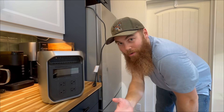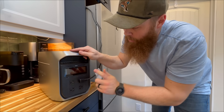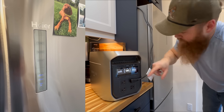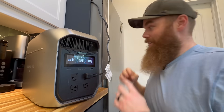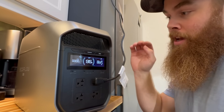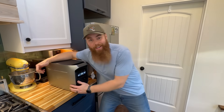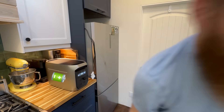After communications, the next thing you want to do is be able to power your fridge — you don't want food spoiling, plus you want to be able to eat. So I'm going to plug into the front 120-volt plug here and turn on AC control. After 10 minutes of letting the compressor spool up and everything, I expected the battery percentage to drop, and it hasn't. I'm genuinely surprised. We are currently able to run this fridge for one and a half days — a full-size refrigerator. This is where a 2-kilowatt unit really shines. It's running off battery storage alone and it still can do it for a day and a half.